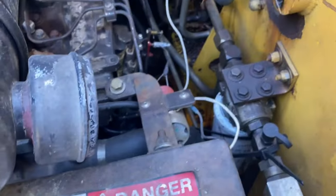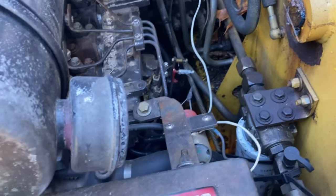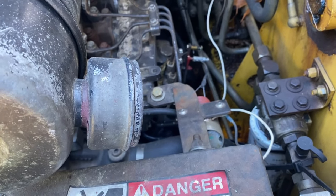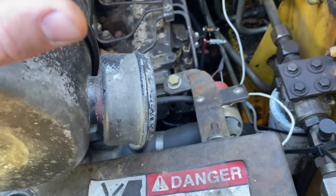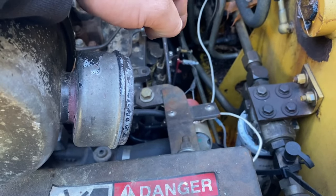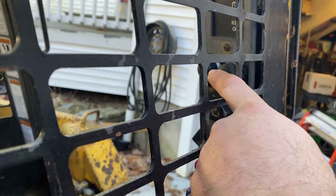So I just worked it back and forth by hand, and then also electrically, and I put a new fuse in up front, and now it works. The lights are tied into the same circuit, and this is tied into the same circuit, so it's possible that it's just a little bit overloaded. This solenoid is a little bit overkill for what it is, and right now it's hooked up to this extra side button that I put in right next to the horn.